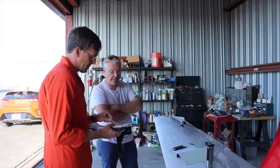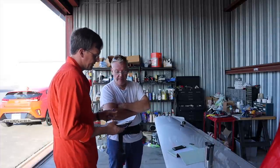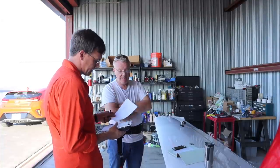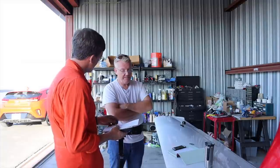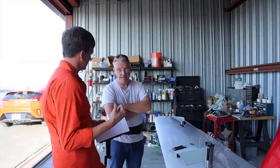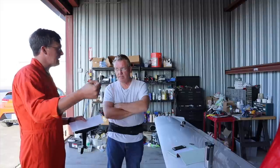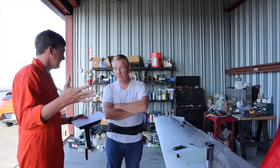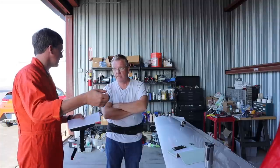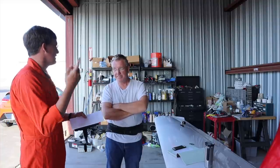We should also keep an eye on the EGT, because that's the mixture. So for EGT, for takeoff leaning versus cruise leaning, do you want to try to knock that out, quantify that? What I would say is, if it's like it was with the injection, full power, and it's running rough, I'm going to lean until it's not running rough. Yes. And then we're going to climb. Once we get above and get the gear sucked up, then we'll do some fine tuning based on EGT numbers, since I'm not going to do a peak check during the initial climb.